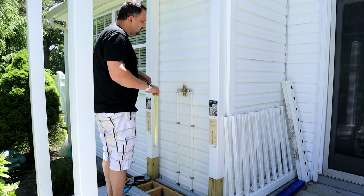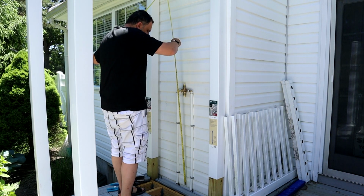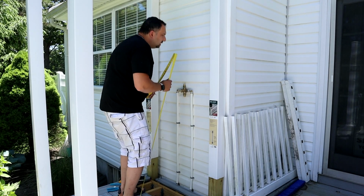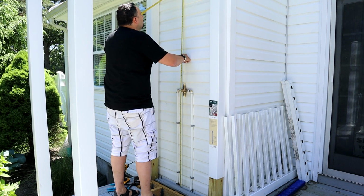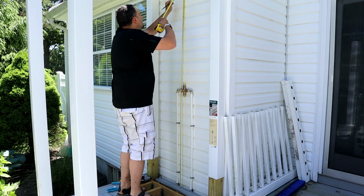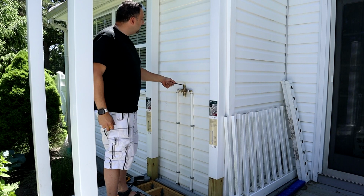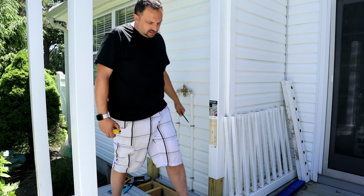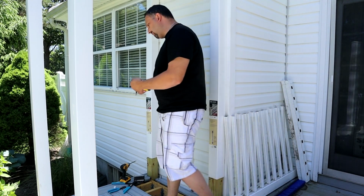Shower head to be 7 feet, a little bit higher than we usually put it, but I'm tall, and I don't like when I'm using the showers when I have to be hunched over to wash my hair. So I always put my shower rough-in at 7 feet. All right, so now we need a piece of PEX from the top of the shower valve up to that, and we will put in one of our drop ear elbows on the top here.